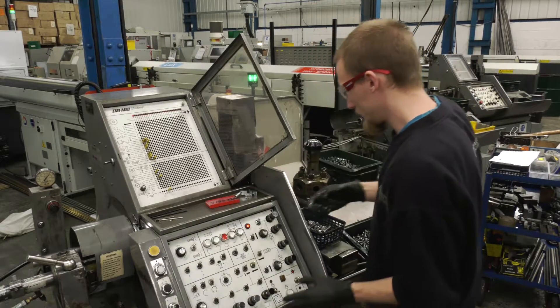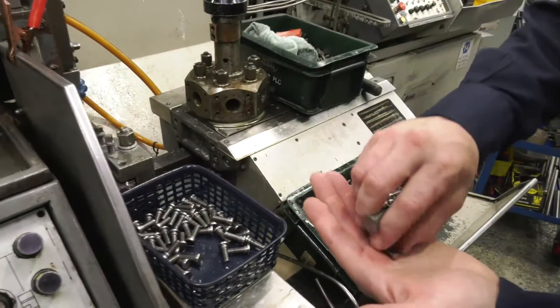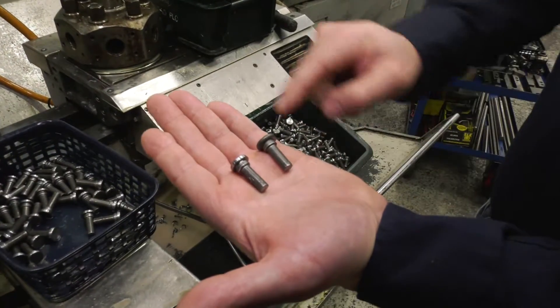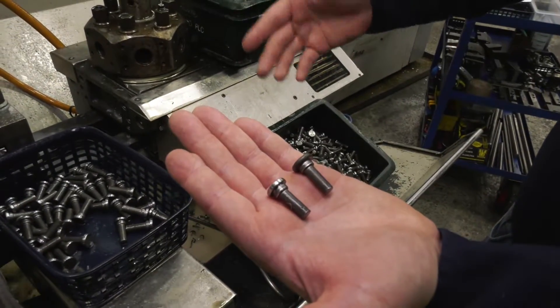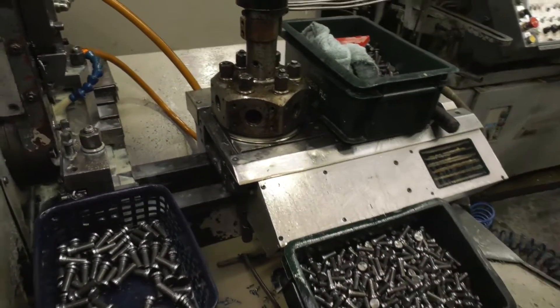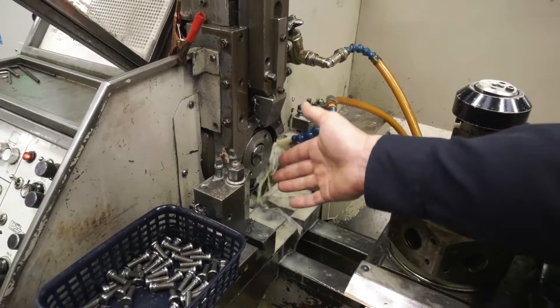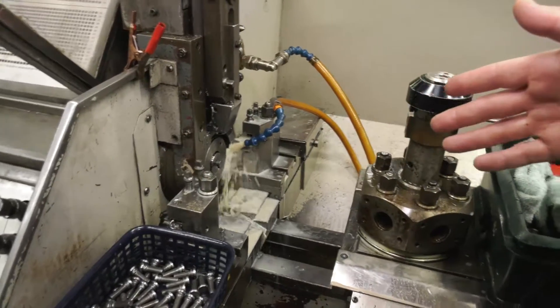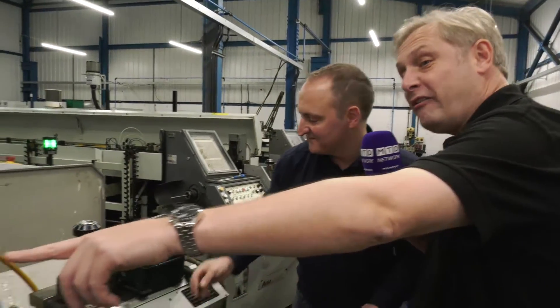And you're still doing a job here, just quickly? Yes, so we're machining forge fasteners here — we've got a forge fastener, we're turning it into that, and then we're thread rolling it and knurling it afterwards, and it's manually loaded. You've got the three tools there — front, back, top tools — all coming in at the same time, with water-based coolant, and a 12-foot bar feed.